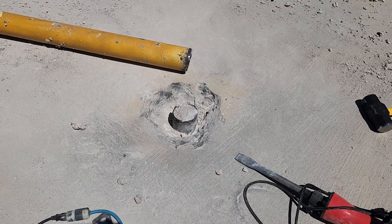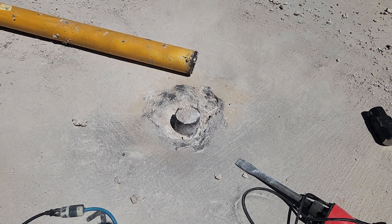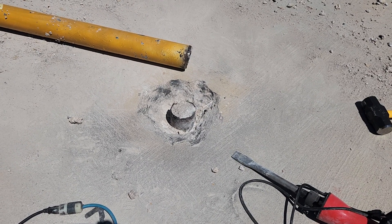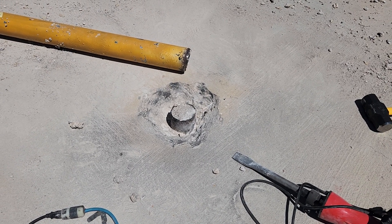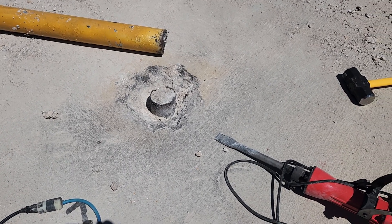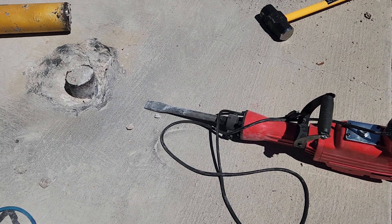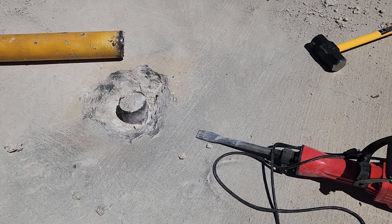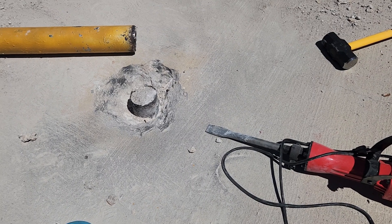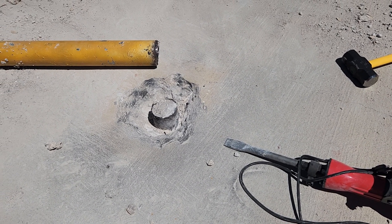I basically cut my way around the bottom of the bollard. Then, with that slot of metal removed — and there's concrete inside the metal tube — I took my jackhammer pretty much as you see it and jackhammered my way into the exposed area of the concrete, just to give it some kind of pilot split.